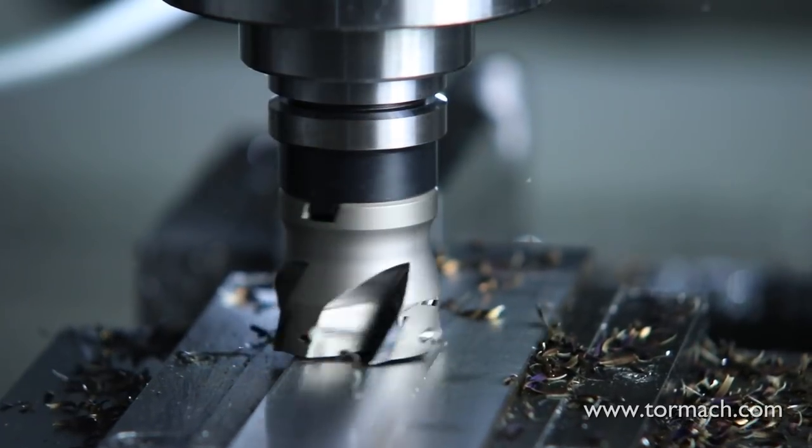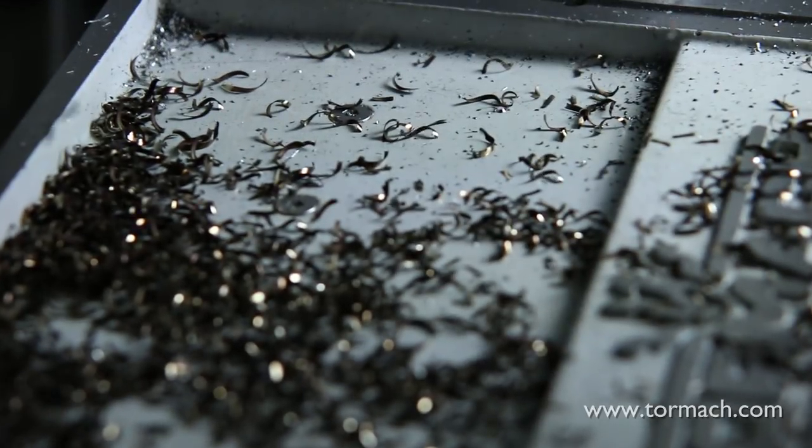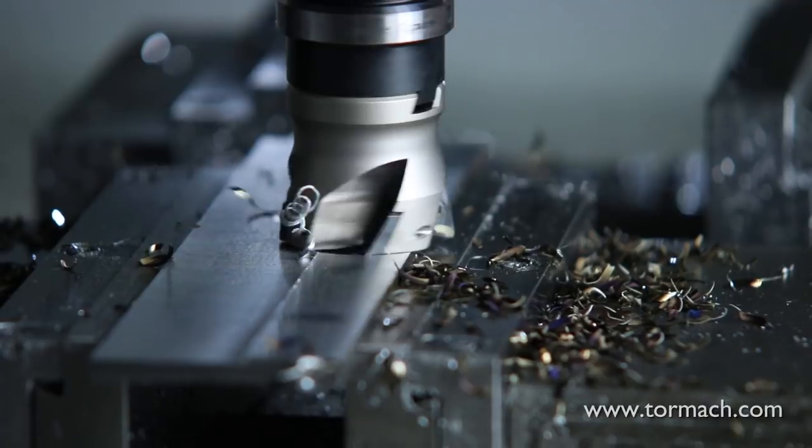It's usually recommended that you position the cutter off-center from your workpiece when face milling. This provides the thinnest chip at the cutter's exit, which leads to a cleaner cut and finer finish. To this end, frequent entering and exiting of the workpiece should be avoided, as it can create stresses on the cutting edge that may result in dwell and chatter tendencies. For the same reason, you should also try to avoid face milling over holes or slots, because these edges can cause multiple cut entries and exits.